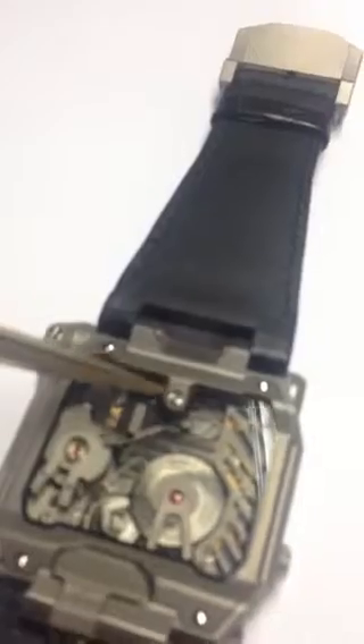In case the result is not zero, we need to set the movement. There's a little screw over there so you can adjust it, plus or minus. You have a little indication on the side, and you can do the test one more time to see if you get close to zero. But actually, the watch is absolutely perfect, so we won't touch it.